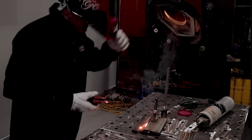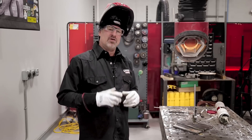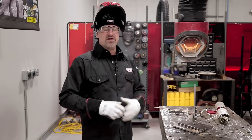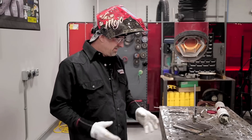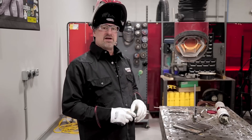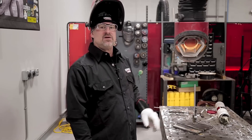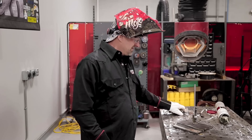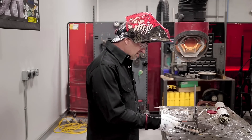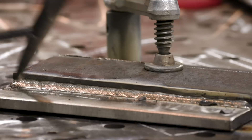Coming down, you can see that rod angle is about the same — 20 to 25 degrees, same speed. So you can see how well the lap joint turned out. I stretched that rod and it made eight inches. I haven't chipped the slag yet to see what it looks like, but normally you should weld down to the numbers. I got lucky and made the whole width of eight inches. I like to let the slag cool off because if you touch that slag it'll jump on you — it burns. The slag holds the heat because of the stainless. You don't really need to beat it up because the 16 slag removes real easy — you just touch it and it pops right off.